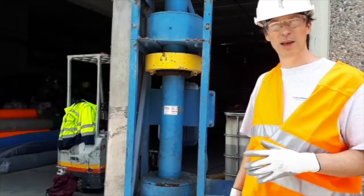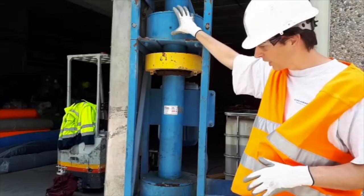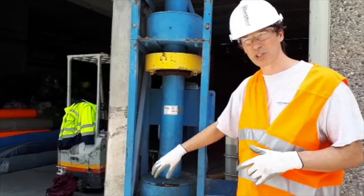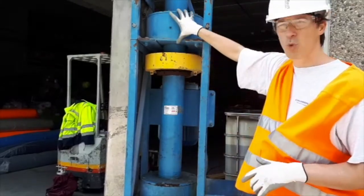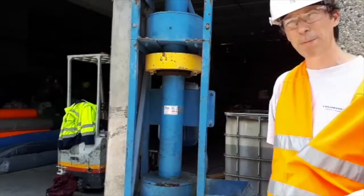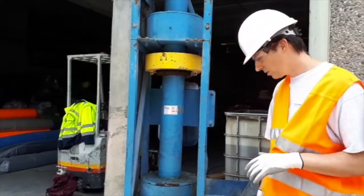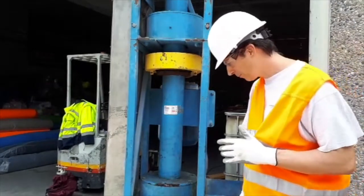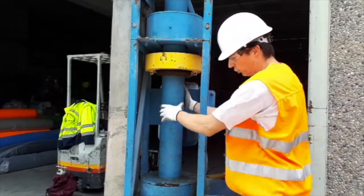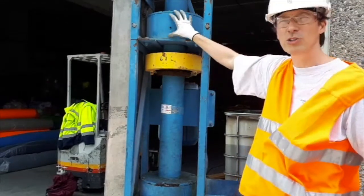We'll have a look at the bearings in your average Olds Elevator. If it's not too high, you'll have two. Inside this casing — this is an old machine used for testing — there is another casing with bearings inside. You will typically have one above the drive and another one below, so the tube is centered and calibrated. These two bearings allow you to turn the tube. Inside there is the static screw.